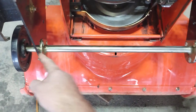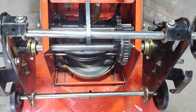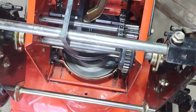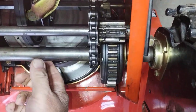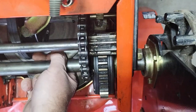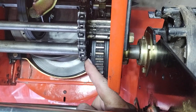That width is set by these flanges, so the width of these plates is fixed — they cannot get wider, they cannot get narrower. However, when you look at this assembly, the whole assembly has play in it. I'm not too concerned about that, but if you look here, you can see there's play where the differential gear slides on this whole assembly, getting to a tolerance of about an eighth of an inch between the differential and the edge of the chain on the pinion gear.